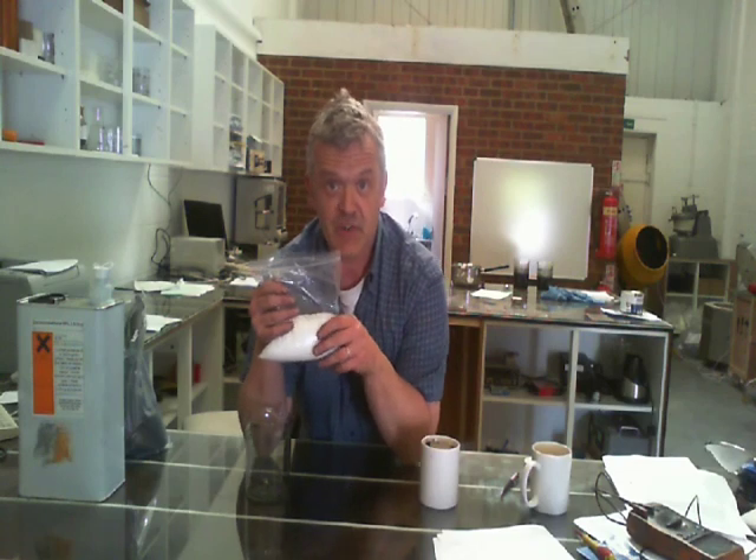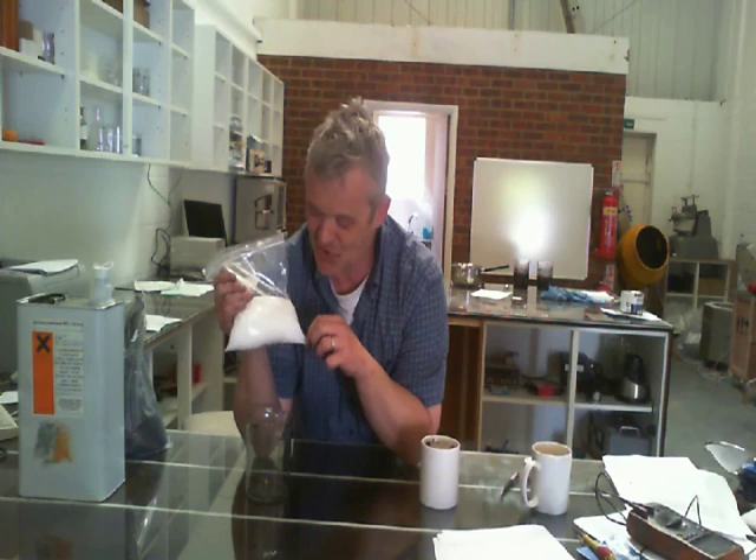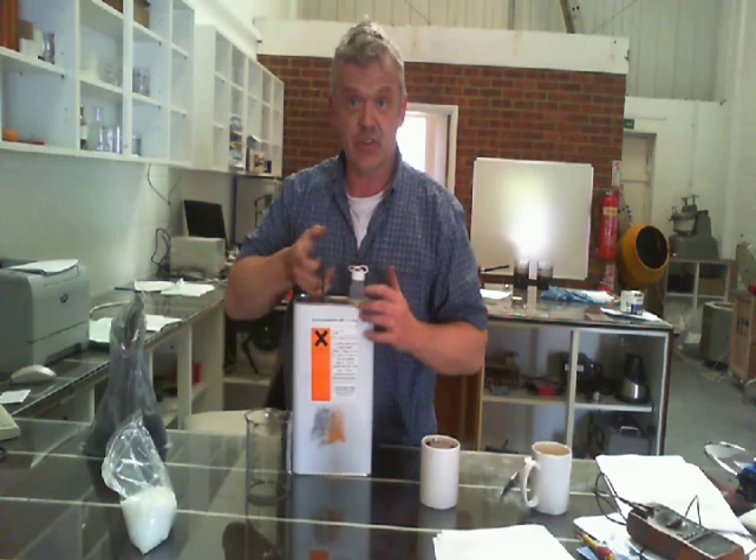Somewhere between 15 to 40 percent is going to be about right — the right balance between conductivity and flexibility for getting through the print. You might think you just melt the plastic and stir the graphite in, and you can try that, but it's a nightmare. It creates a huge sticky mess, it remains quite thick before it starts to burn, and the graphite just won't go in. The methodology used — from a paper called 'A Simple Low-Cost Conductive Composite Material for 3D Printing of Electronic Sensors' — is a solvent casting method.